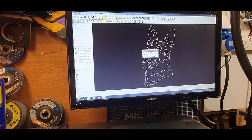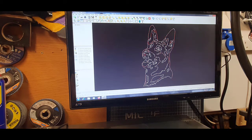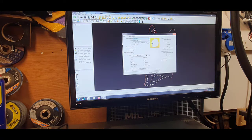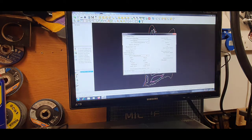I'll call it 'outside cut' and make sure it's set as outside cut - and that's pretty much it done. From here we import the job. We always do the inside offset first - inside cut. These tools here are preset up for your plasma cutter. I find this is ample. Everything's set at 1.8. That's the first slot done - there are my cuts. I can quickly see what's been cut out. Second one is your outside offset - outside cut, pretty much standard all preset - and away you go.